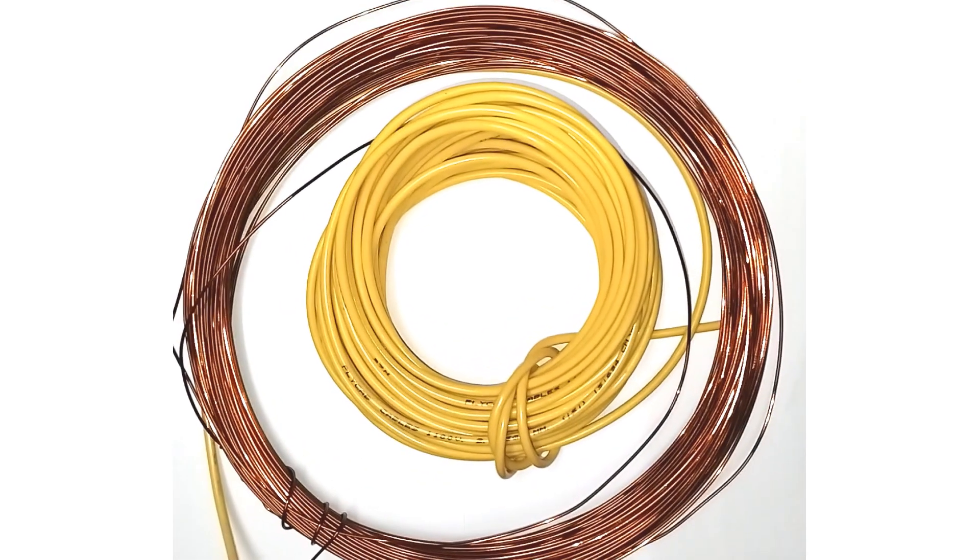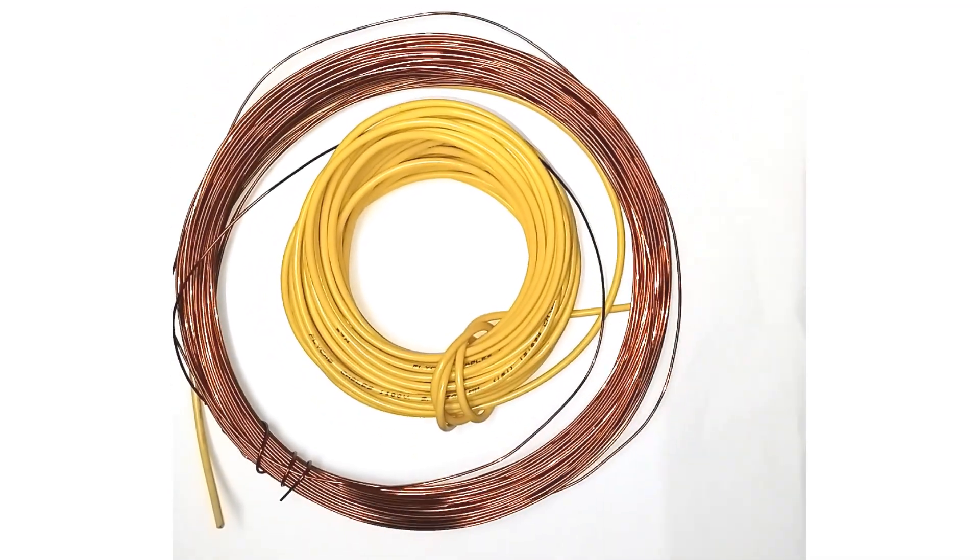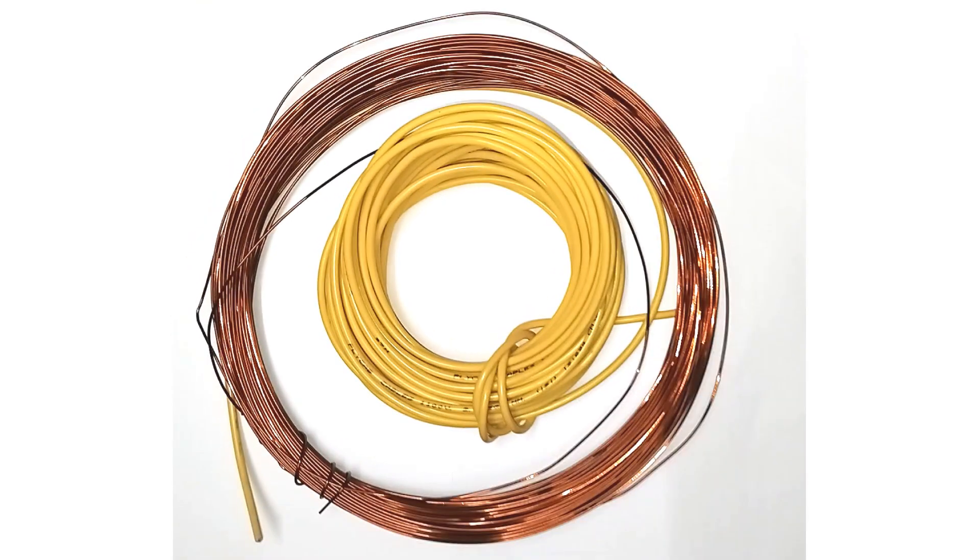As I was not quite sure of how much enamel copper wire I would need, I went out and bought 500 grams of 18 SWG enamel copper wire along with 15 meters of 2.5 square millimeter insulated copper wire, of which I will need 14 meters for the antenna. The remaining part may be kept as extra for tuning and tying the antenna, meant to be kept folded on either side. Now I have to cut pieces of PVC pipe and wind the loading coils, as well as cut the antenna, mount it and tune it.